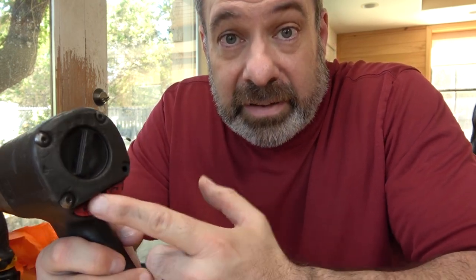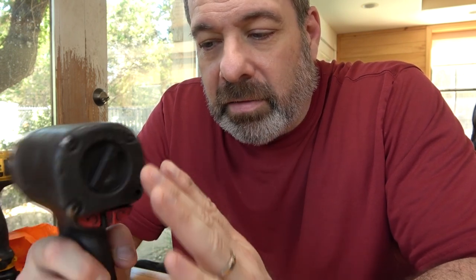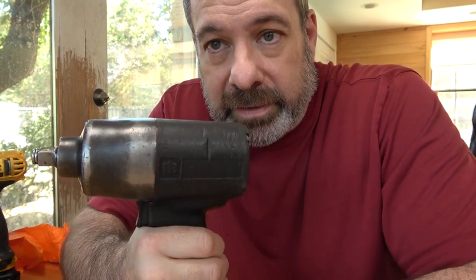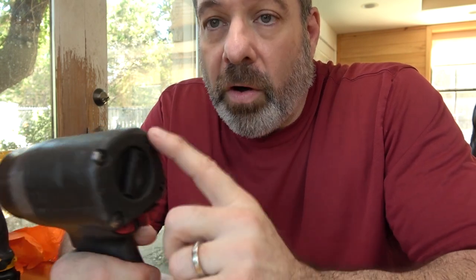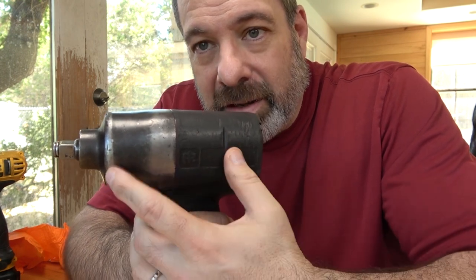In addition to having low power, the owner told me that the selective switches are kind of weird — he says one of them tends to pull out. I don't know if that means it doesn't redirect the air; we're going to test that and find out. When I took a look at the unit I noticed this screw here is missing, and that's a very important screw. There are four of them that go through the body into the hammer case. The hammer case and the motor housing — the body — is separated by a gasket.